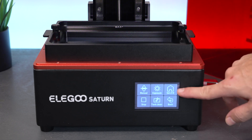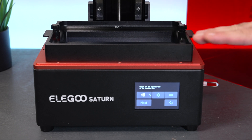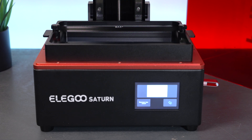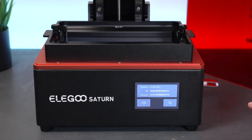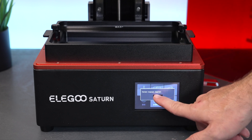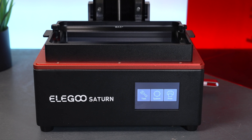If you see that UV pattern projected, everything is working great. Set to zero we don't need; stop halts whatever the printer is doing. Tank clean is similar to the exposure test but opens all the light to the tank — it fills the whole tank with UV light. This is great after you're done printing: pour out the resin and solidify whatever remains so you can clean it out. Under System we have printer information, sound settings, internet connection for the ethernet port, service contacts, and language options — English or Chinese. The last menu is Print, which reads the thumb drive on the side.